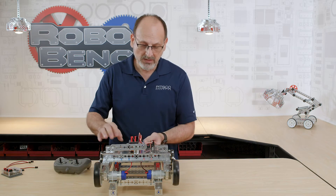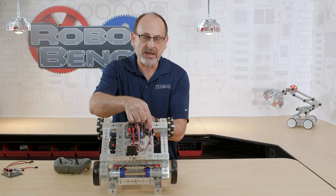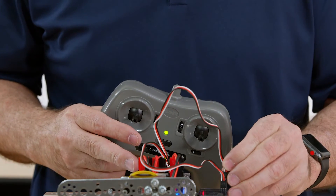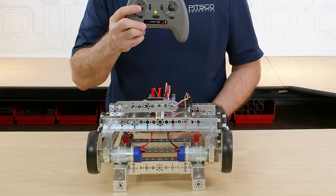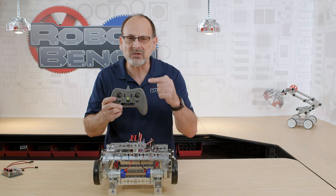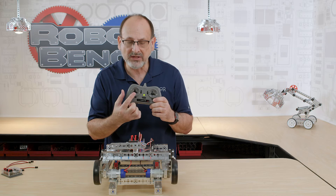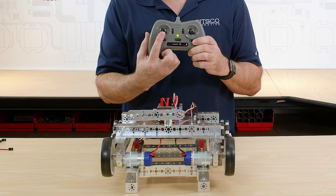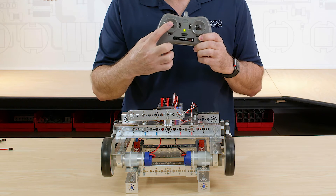Now if I put this into mixed mode, all I have to do is press the button right up here. I get a yellow light showing me I'm in mixed mode. Now I can move my channels on my receiver to a single stick — I'm going to take input one and move it up to channel four. Once I do that, as I move my joystick vertically, it mixes the power between the two motors. That's the secret of mixed mode. Without it, to get both motors going the same direction at the same speed, I'd have to hold the joystick at an angle, which is very inconvenient. This makes it easy: when I push my joystick forward, it mixes the power between the two wheels and makes the robot go forward, and the same for back and side to side.